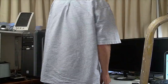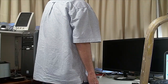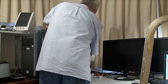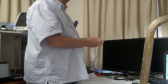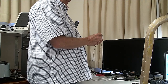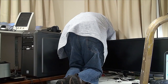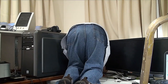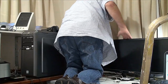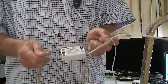The telephone currently goes through a lightning inhibitor on the power board, and we've been advised to remove that — don't go through the lightning inhibitor. So I'll take those wires out of the power board. The other thing we've been told to remove is this ADSL inline filter or splitter, which allowed you to have an ADSL modem and a local phone line in it. So take those splitters out of the line. Now I have to get down in here and disconnect it from the wall. More wires to discard including the splitter.